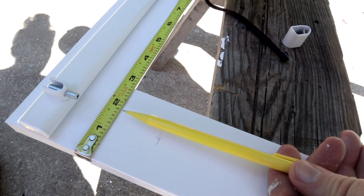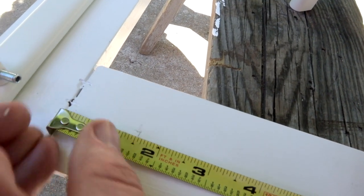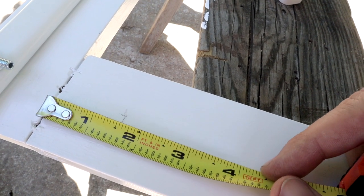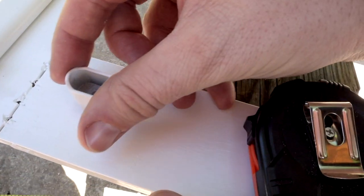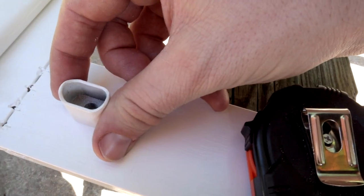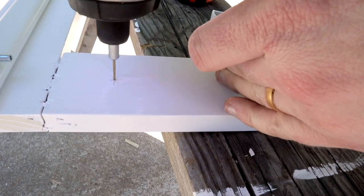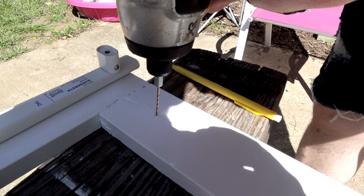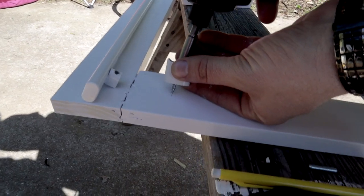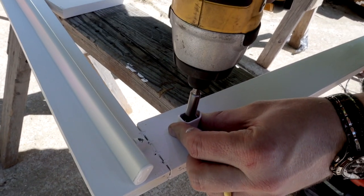Now come the important measurements. We're going to make our first rung one and a half inches from where the header meets the top of the leg. Make your mark one and a half inches down and one and three-sixteenths inches away from the outside of the ladder. After the marks are made, drill a pilot hole — I used a one-sixteenth-of-an-inch drill bit. The holes are there so that when you screw in the base of the rails, they go exactly where you want them. Note: the IKEA rails don't come with screws for mounting, so we'll link what we used in the description.